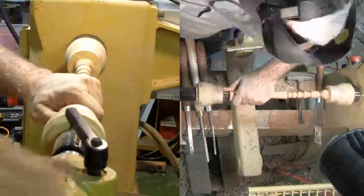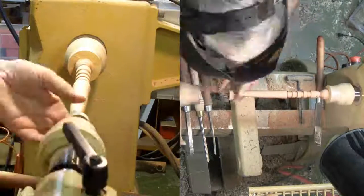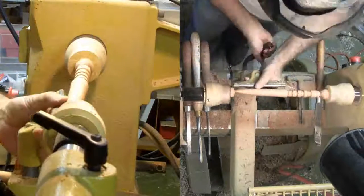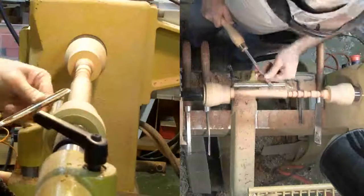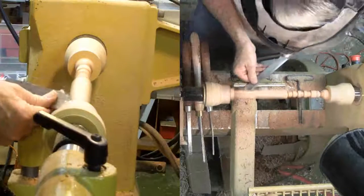Then shift the axis 1/4 inch the other way and repeat. The ghost image is not a reliable guide. I'm having to stop frequently to gauge progress. For sanding, I'm having to use long strips of cloth-backed sandpaper to keep my hands away. Paper-backed sandpaper just does not stand up to the task.